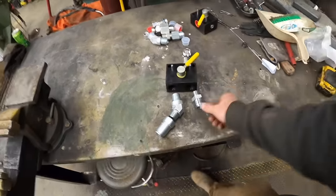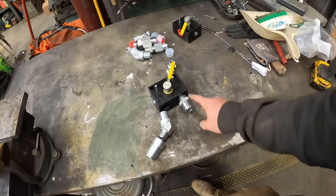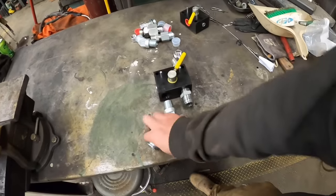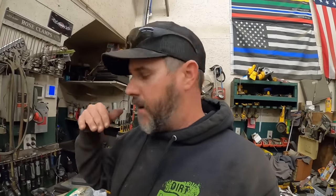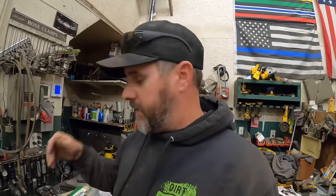And then once we come out the other side, the thumb is going to continue to be what I'm gonna call hard plumbed in. So I got an adapter to go into there. The 90 for the thumb will go on in and go on out. And then we'll put a quick attach on this one. I'm gonna put it at a 45, because in my head, as that comes down in 45s, it'll give us a little better shot going back to the tilt bucket or the attachments.